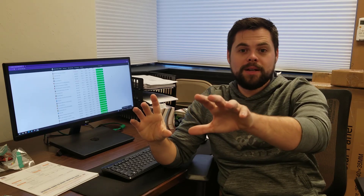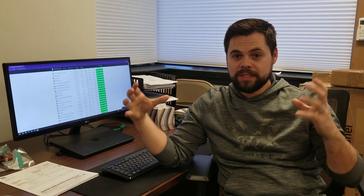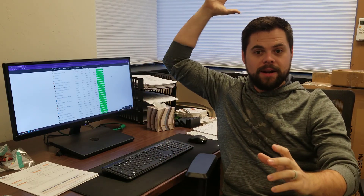Most people will probably start in their garage. If you're going to do this in the garage, at minimum you're going to want to crack your garage door so you get some air coming in and then maybe have a window with exhaust fans going out. That may work for one or two miners, but each of the Goldshell KD5 miners generates about 2,300 watts of heat. To put that in perspective, that's about two standalone space heaters on high. So imagine having eight of those in a room — it's going to heat up pretty fast. Even two of them will heat up a garage quickly. Some people also use window air conditioner units with ducting straight to the miner and an exhaust fan taking the air out as well.